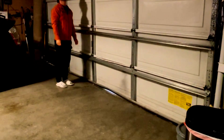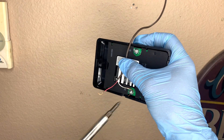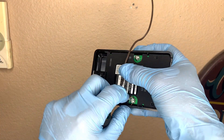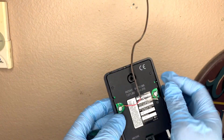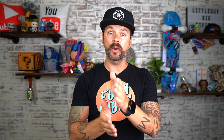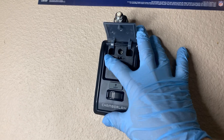You're going to install the actual garage door opener on your wall. The kit comes with its own wiring, but I was able to use the existing. You just need a Phillips screwdriver. Flip it over and you'll see it has a color code on it — correlate that with the wires you see and match it for whatever color it tells you. Find an area where you can screw it into the wall, put the screws in, mount it on, and you are good to go.